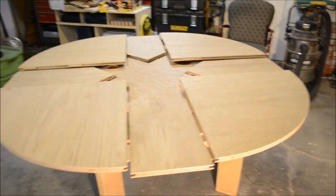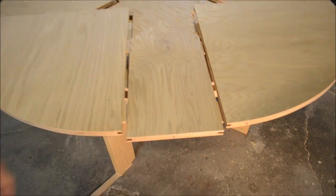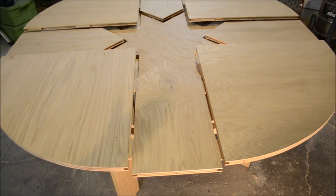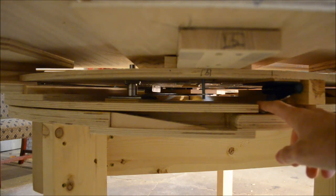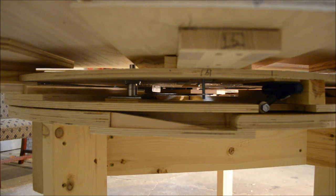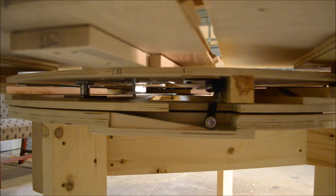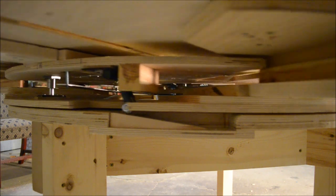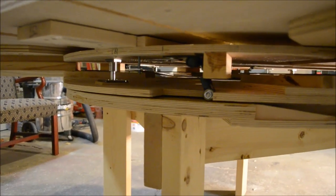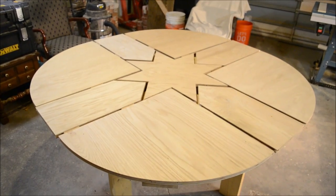You can see that things are still at different heights, but they've opened up enough that the panels are clearing each other and there's space between them for these tongue and groove panels to clear — because it has to open up far enough for them to clear, rise up, and then come back together. What we've got here is that roller that we mentioned; it's still in the retracted position, going to flip down and then ride up the ramp. Continue rotating the table, which is now at its fully expanded point — it's down and it lifts it up. The entire table has now become the same height.